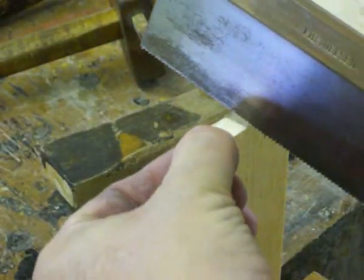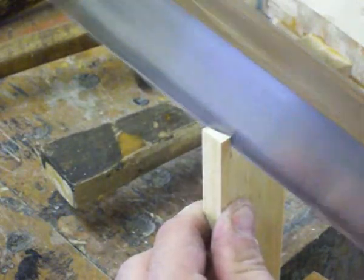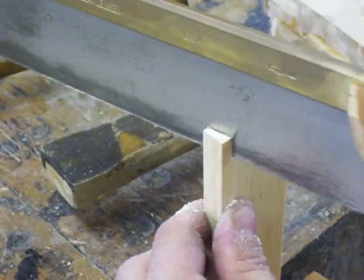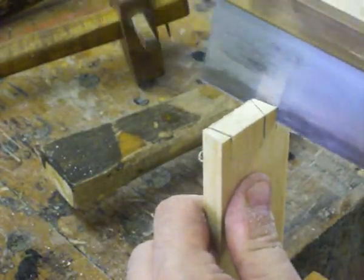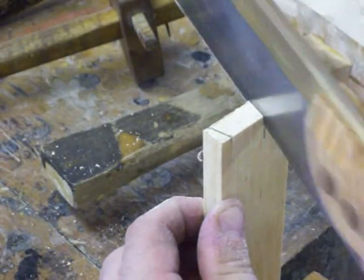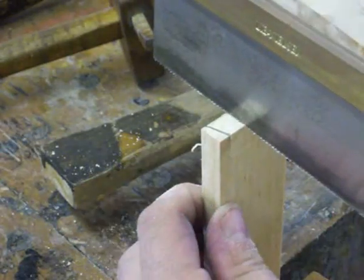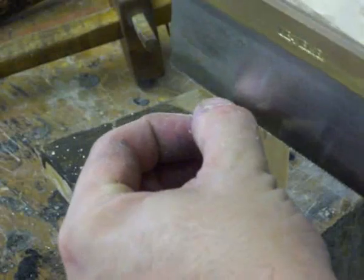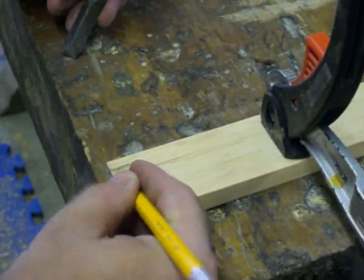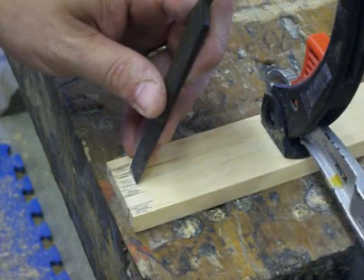Now we're ready to start our saw cut. I'm just using my thumb as a reference point to get me started, make a slight cut there, and then move my fingers. I go right down to the scribe line on the back. This is a very nice sharp saw and it does a great job; in this pine it's so soft that about anything will saw it. I stay at the same angle until I get all those cuts done, then change my angle. I did those two cuts going the same way first so I didn't have to change my hand position, then came back and did the other one. Now I'm just making a couple of saw cuts in the waste so that it's easier to chop out. Make sure that you don't cut your tails instead of the waste — it's very easy to get confused and do that.